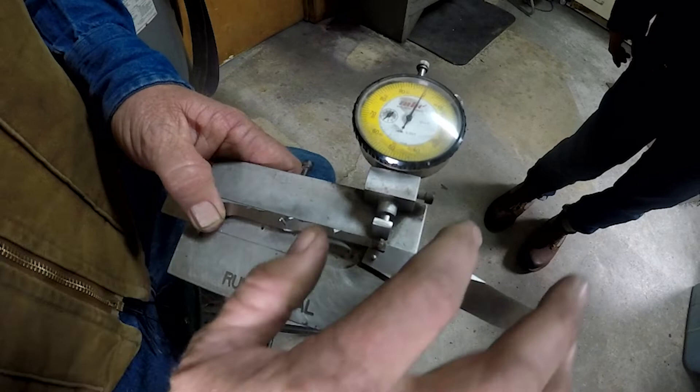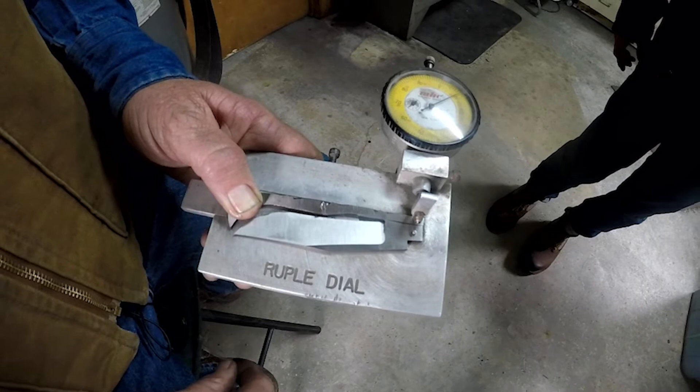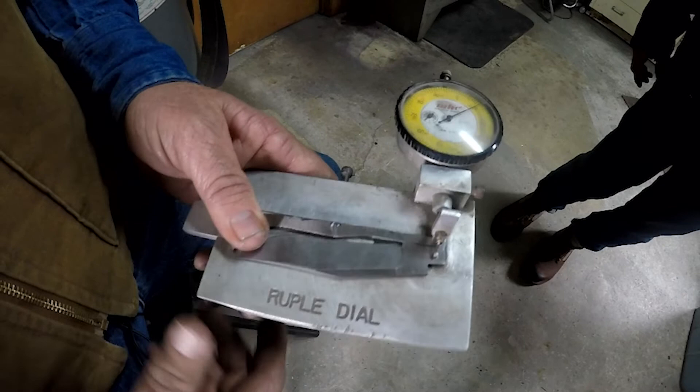You can zero it out at the open position, and at half stop you want to be about five to ten thou on it, and at close ten to fifteen is adequate — and you're still leaving some room to remove the carbon after heat treat.